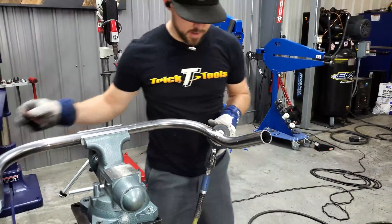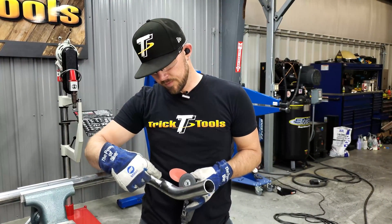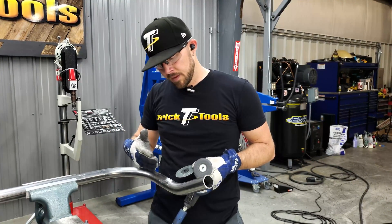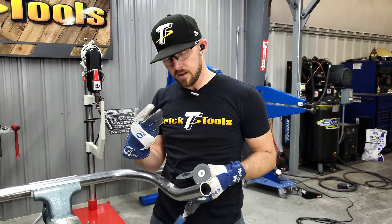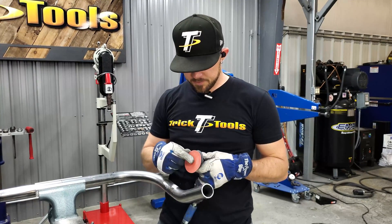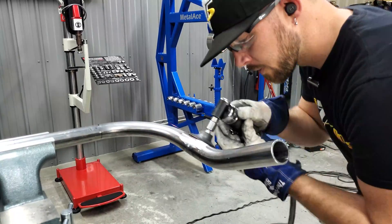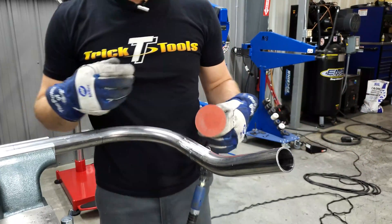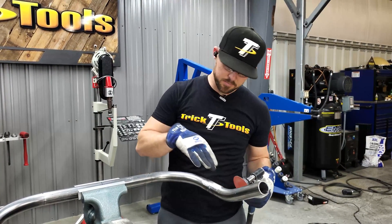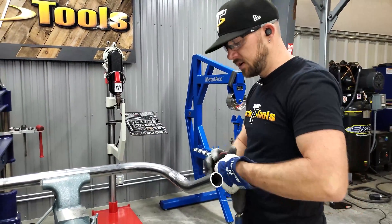After sanding a bit, you're blending the surface together. With the disc coming across in this direction, it's not gouging deep into the base material - you're not taking off a lot of material or compromising the strength of the part. I step up to 120 and do the same thing. Also, I'm not applying a ton of pressure - I'm just letting the disc skim the surface as I move it around to blend it all together and not gouge deep into the surface. Then stepping up to the medium coarseness scotch-brite.